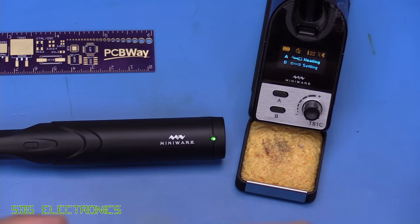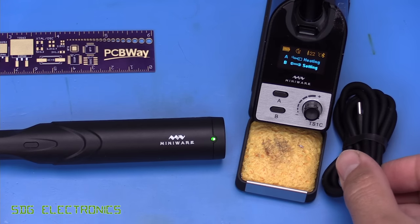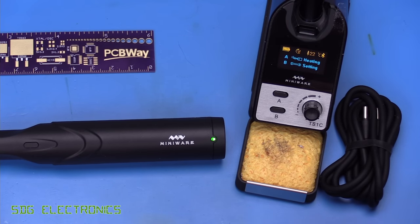One thing to note: this doesn't come with a power supply, only with the USB-C cable. So you do need your own power supply, and it needs to be a USB-C power delivery type. I'm using an Anker branded one — I'll put a link in the description below — but anyone suitable for power delivery with an output power greater than 45 watts should do the job.